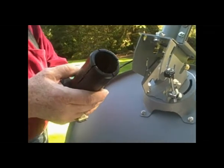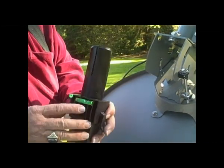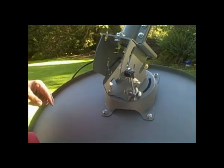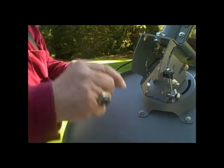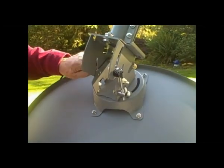This is the 2-inch OD post. It has the built-in levels on it. The first thing we'll do is to replace the nuts that come with the dish — these are 9-sixteenths, 18 turns to the inch nuts — and we'll replace them with nylon wing nuts.